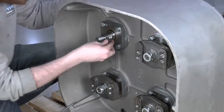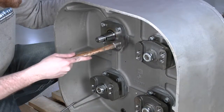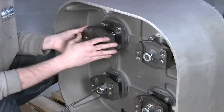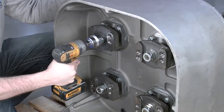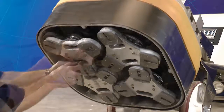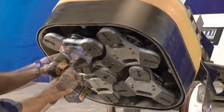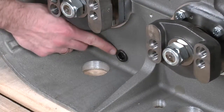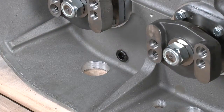After the seal cover is secured, install woodruff key and replace the drive plate. To complete the installation, reattach the tool plate and coupler assembly. After the seal change process has been completed, replace the oil drain plug.